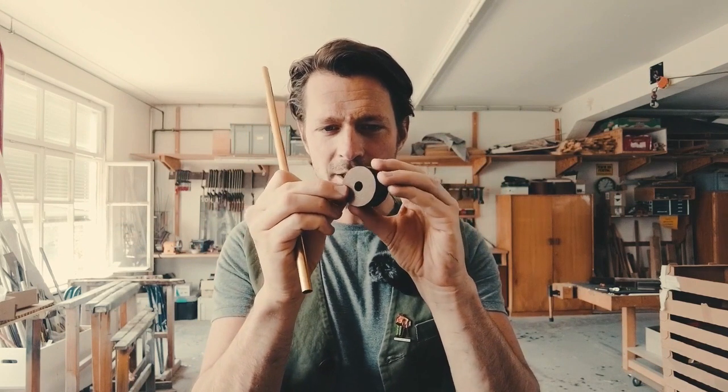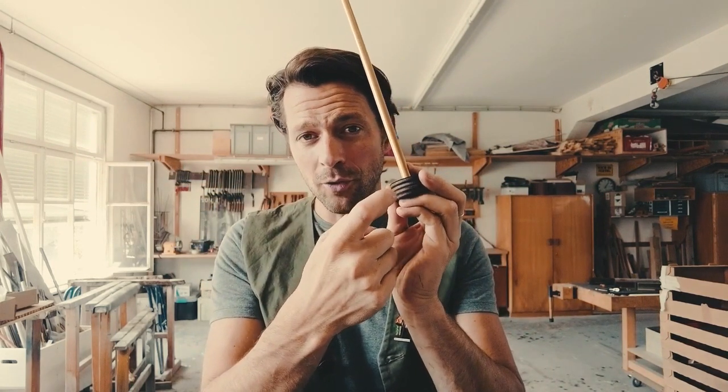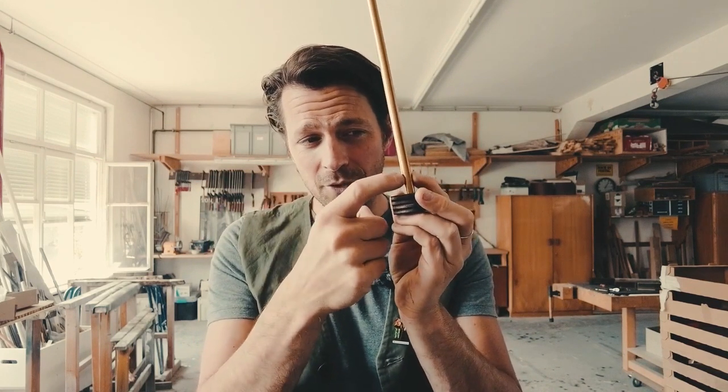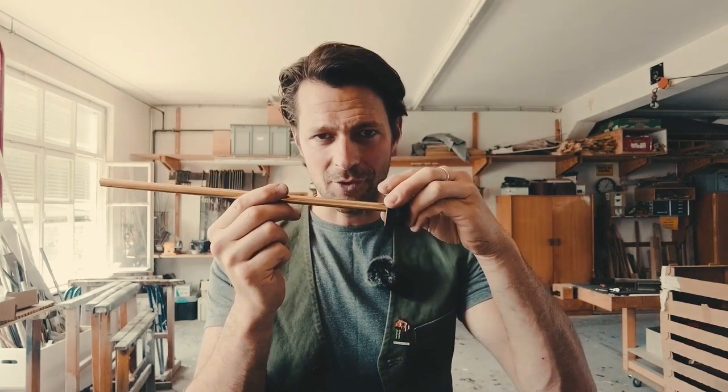For the focusing rod, there are two circular pieces that make your knob — one has a complete hole and the other a half hole. Glue those together and glue it onto the rod with super glue or contact glue. It's advisable to also drill a hole with a metal drill bit to create a hole in the rod, then put in a screw so it's really well attached.